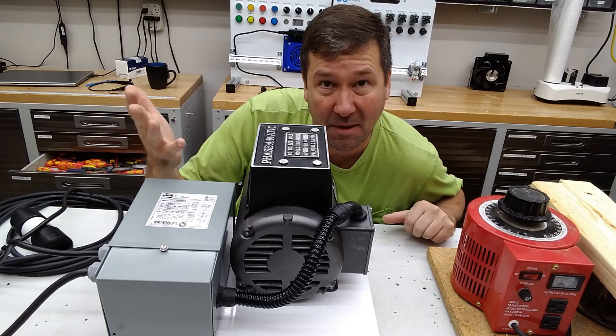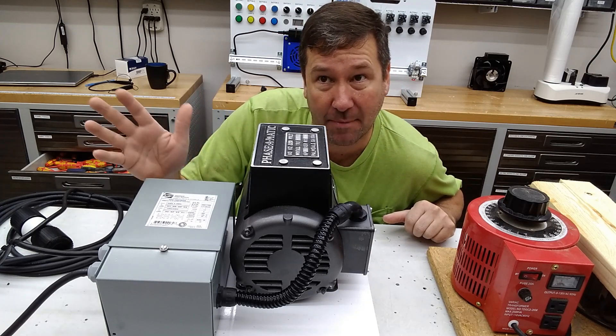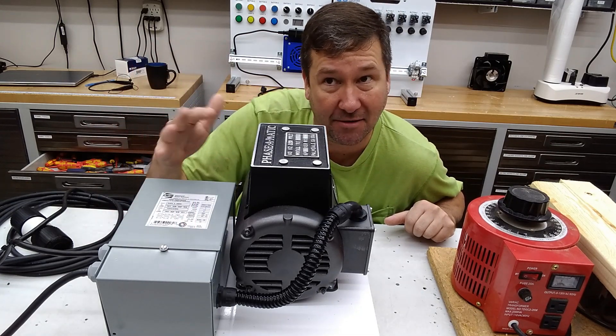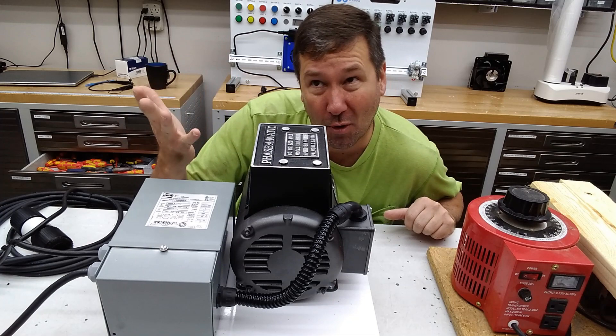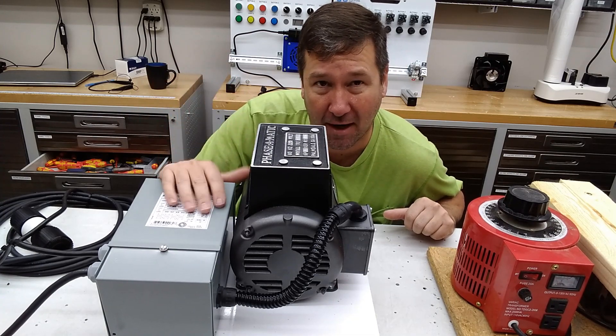Your typical outlet is going to be 15 amps. You can have it 80% loaded and that would be 12 amps. And then we're going to take it from 120 to 220 with the single phase transformer, so that's going to take you down to 6 amps. And then by the time you actually make three phase power out of it you have about 4 amps available. I didn't do any math on that, I just threw those numbers out of my head, but they sound roughly right.